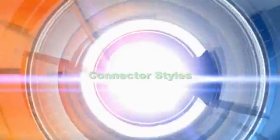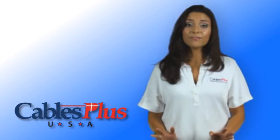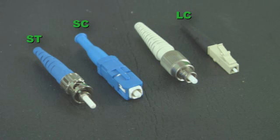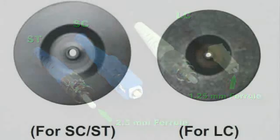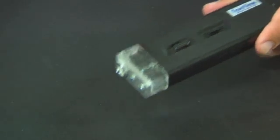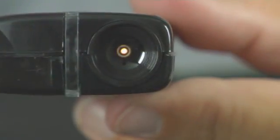There are a wide variety of connector styles available, but the vast majority for common telecommunications and data center applications are the ST and SC that use a 2.5 millimeter ferrule, or LC with a 1.25 millimeter ferrule. This is important as you will need a polishing puck that matches the ferrule size in some adhesive style kits, and all kits require a microscope with suitable adapters, even if only checking for cleanliness.